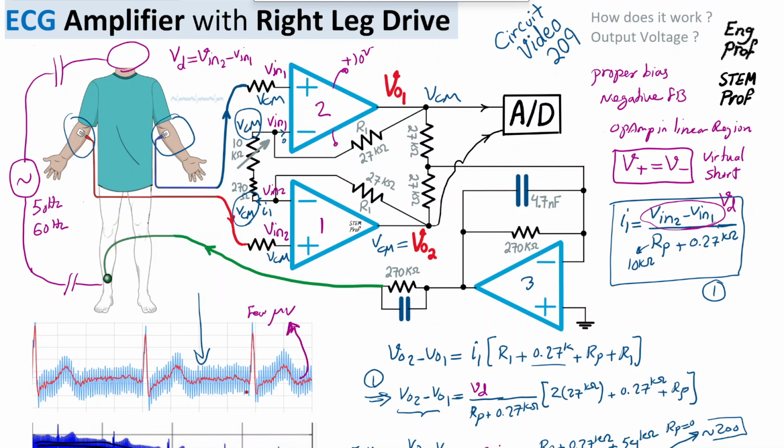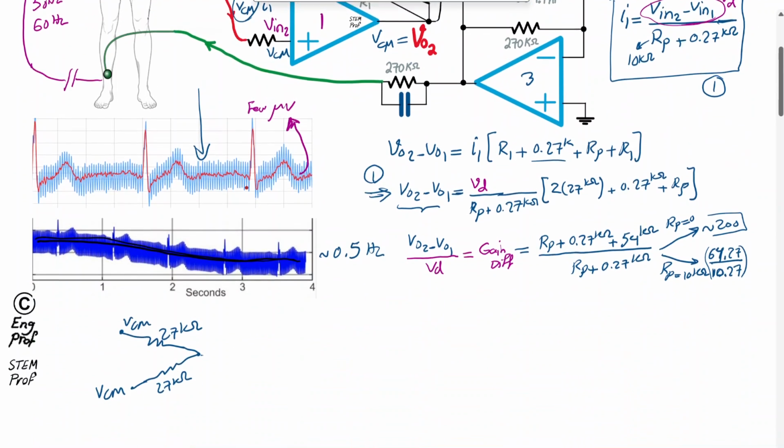Okay, so one interesting thing as well is for differential voltage, because V out 2 is going to be, for example, exactly the negated version of V out 1. Therefore, since V out 1 and V out 2 are exactly negated versions of each other, the center node will be 0 for the differential mode. So basically, ideally, the differential signal doesn't contribute anything to the input of this feedback network. So the only input that appears would be V common, as I showed you. The differential or desired signal is not contributing to the feedback network.